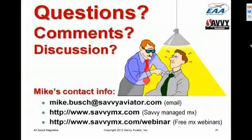Well, probably so. Actually, the shower spark system is the very best. The shower spark system, because of its nature, actually fires a series of sparks rather than just a single one, and is exceptionally good for cold starting. But yeah, having impulse couplings on both mags will give you twice the chance of getting the thing to fire, and so it would be an advantage. Some impulse coupling engines have impulse couplings on both mags, and others have it only on the left mag.